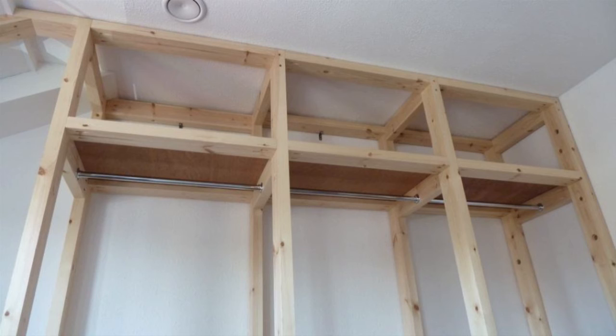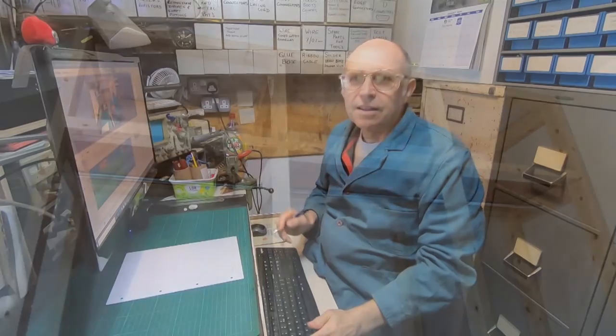The frames went together quite nicely, but you did have to look out for drift as you tighten the pocket hole screws. If I was going to, say, tighten these 2 screws, then to prevent the timber drifting upwards, I would have to place a clamp onto the vertical frame just here. Then I'd tighten the 2 screws. A possible advantage of using this type of fixing is it does enable you to easily remove timbers at a later date if you want to modify something.